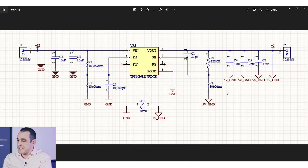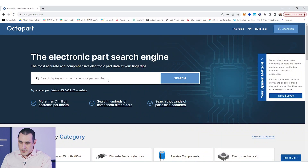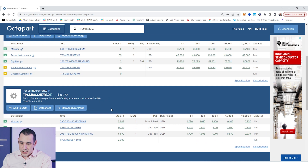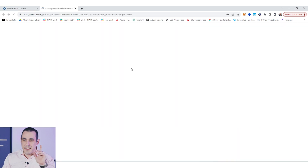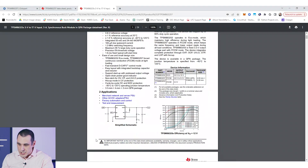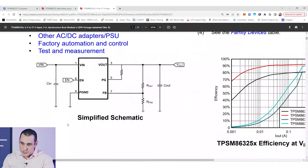In this way, the ferrite bead is basically working like a net tie between the feedback line and the power ground pin — controlling what the return path is for any current on that feedback line, and linking those two grounds back together on the output back to the primary ground on the input. But if you just go on to Octopart, look up the part number, and take a look at the datasheet, you'll see that this circuit doesn't even follow the application guideline.